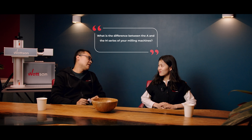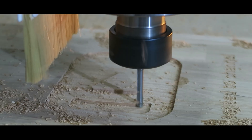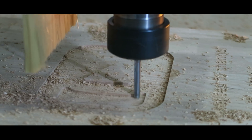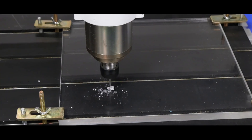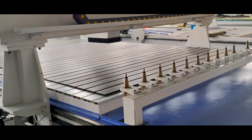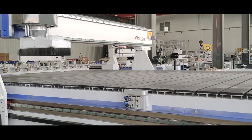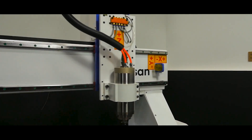What is the difference between the A and the M series of your mini machines? Okay, this is a very good question which customers always ask. The A series is a machine for working with plastics and soft woods with Z200 clearance. You will certainly feel the differences compared to the M1, which will remove more material in one pass. The A1 series uses worm gear reducers with Z200 clearance and has a less thick body than the M1. The M1 has planetary gearboxes, a more powerful spindle, increased body thickness, and Z300 clearance. All this makes it a professional machine for heavy-duty operation.